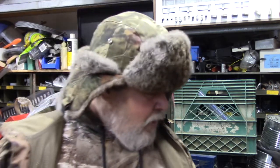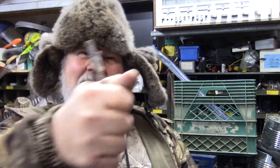He had a radiant heater on the floor. He had an extension cord, probably number 16 wire. You can tell most of these. Can you tell I'm getting excited here? You take this and you just touch the end, the plug. Just touch the plug end. Sometimes just touch the wire next to it, and you'll feel the heat. Well, if you can feel that, that means things aren't going good.